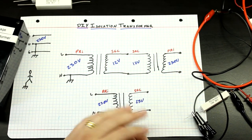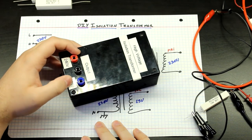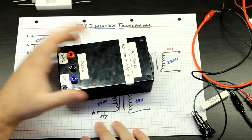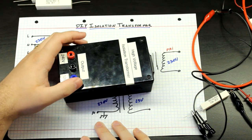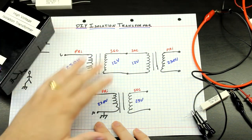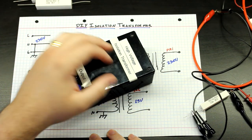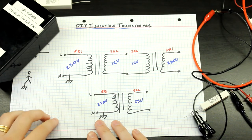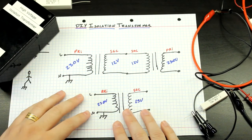If you're going to build an isolation transformer to power our high voltage lab supply, I don't recommend something as small as 6 watts. Go for something like a 30 to 50 watt transformer — two 50-watt transformers back to back will give you enough voltage and current. This is simple stuff you can build yourself, and it's a very important piece of safety gear to have in the lab. Hope you enjoyed it — leave any questions or suggestions in the comments below. See you next time.